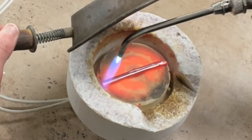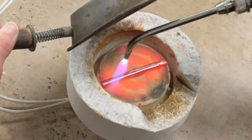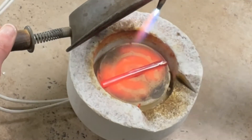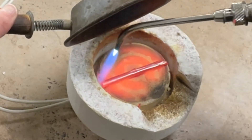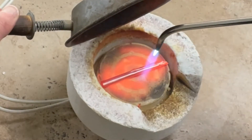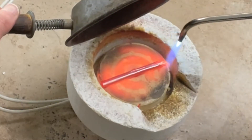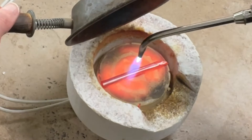You see what a good job Alexis did — you can tell by how easy it was to fuse. You put the lid on — that's okay. Yeah, you've got to get that hotter. That seam has to glow brighter than everything else. Just keep your flame off the very skinny end — the part where it's not touching.